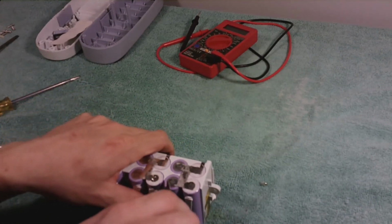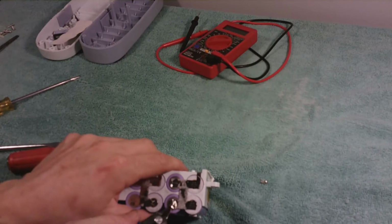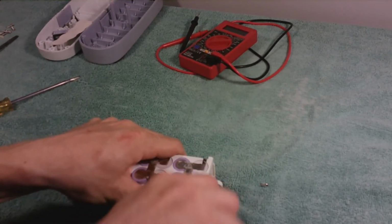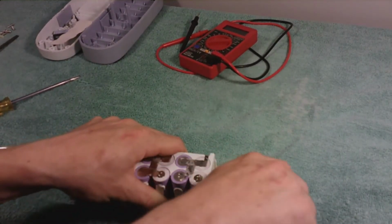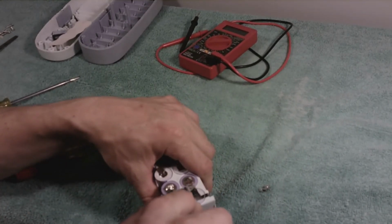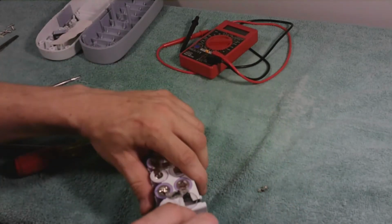So, unfortunately, the LiFePO4 variant, this lithium iron phosphate variant of the battery, is a little bit more expensive, but they offer greater safety and a large charge and discharge life expectancy as well. So if you were to Google the regular lithium ion batteries like I'm taking apart in this video, it says that the life cycle is around 3 to 500. Now, a lot of people that use these batteries report that it's more like a 2000 range, and that's 2000 cycles, so that's charge and discharge. So if you were to charge it and discharge it once a day, that would be about 2000 days that this battery would be expected to live.